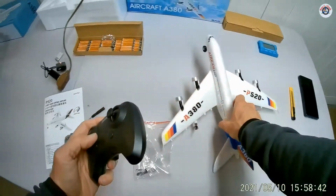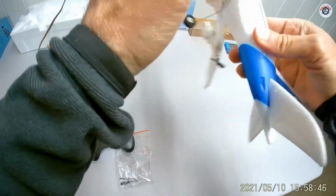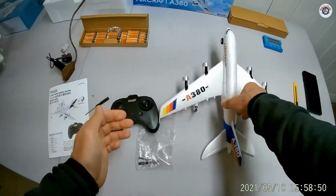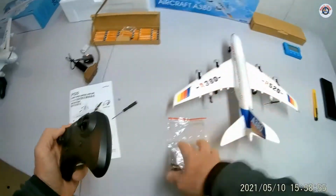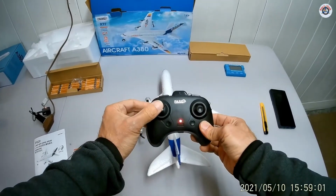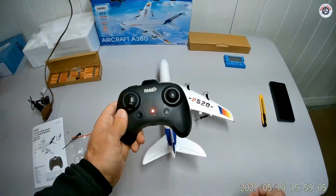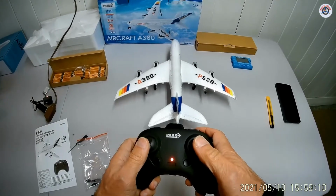And turn on. Still not sitting flat. Maybe it's something to do with the location of these funky little... Okay, here we go. Now it just sits on this landing gear. Funky landing gear. Turn this one on and the throttle goes all the way up. Beeps. Down, beeps again, longer beep, and this red light stopped blinking. And we have power.